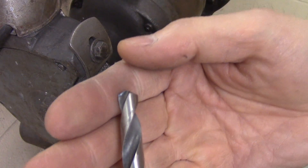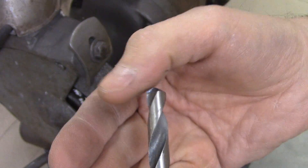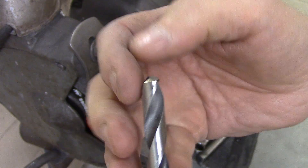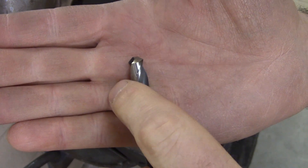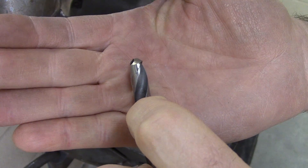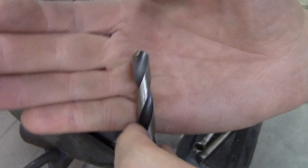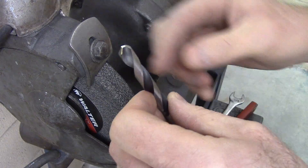If you look at the edge of this drill bit, I want to see the sharp edge over here on both sides. I want to see a little bit of a back rake coming down at an angle so that this cutting edge is the highest. If you don't have any back rake, it's not going to cut. And I want to have both cutting edges about the same, otherwise you're not going to get the same size hole.